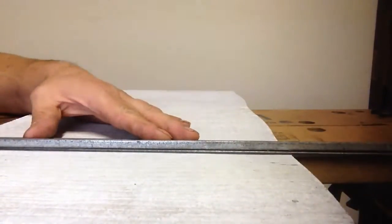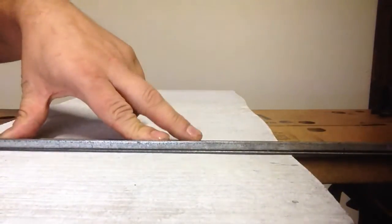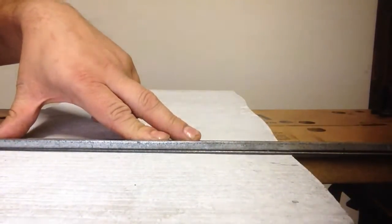We're gonna cut our replacement asbestos siding — of course it's not asbestos anymore, it's cement board. No special tools needed, you just need a straight edge, and you'll go through a lot of utility knife blades.